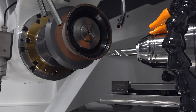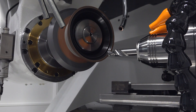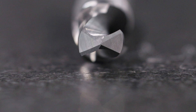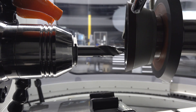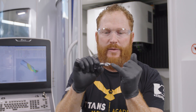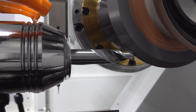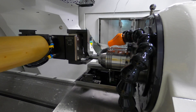Now we're gonna go to my favorite part — the drill tip. This has two clearances on it: a clearance on the tip and a clearance on the backside, a primary and a secondary. This is known as a multi-faceted tip. The term faceted comes from diamonds — if you cut a diamond, all those nice sharp surfaces are facets. It's the same thing on a drill. This drill only cuts in one direction so it's incredibly important that we get these right. There's also some gashing inside of there — a radius gash — and it's gonna aid in getting through material really efficiently.